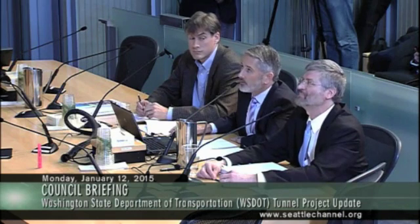The subject of the memorandum was that the engineer of record was satisfied with the contractor's repairs up to that point. However, considering the shaft was getting deeper — and the deeper you go, the more pressure on the shaft — they were asking Seattle Tunnel Partners and subcontractor Malcolm to propose a method of investigating and/or providing additional grout in those yellow gaps underground before excavation proceeded to the next part.